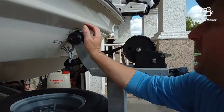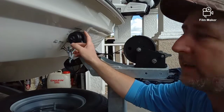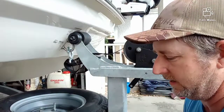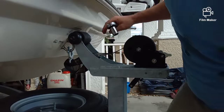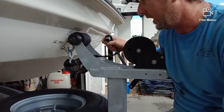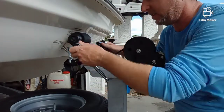I'm probably going to try buying another drum and cutting and making one of these round pads on each side so that it's uniform, but I want to see how well it works before I go wasting more money. The oscillating sander drum was actually pretty cheap, and it was easy to cut — just take a hacksaw and cut slow so that it's nice and straight.